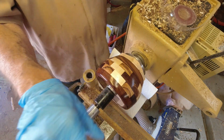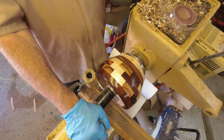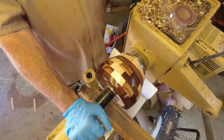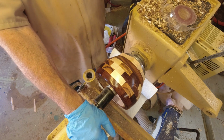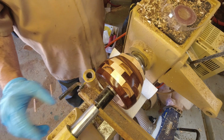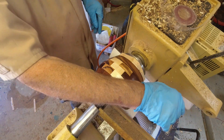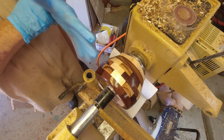So I can touch this right now. I don't need to because I already know that this is already dry. The reason it's dry is because it's a 2-pound cut. It's a 4-to-1 dealio. I've got 4 times the amount of isopropyl as I have flakes in there. So that isopropyl alcohol, without anything, dries to the touch quickly. So does this. That's why I like using it. Yeah, that's dry. I can put another coat on now. That's another reason why I like doing it. I like putting on a few coats at a time.